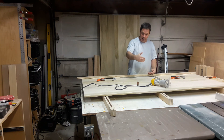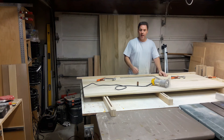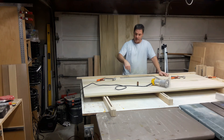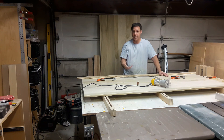I'll just repeat this process nine more times to do all 10 in between. When I cut this door — I've already cut it to length — I found out I have to cut about an inch off each long side so the width ends up proper. But as long as things are symmetrical, they look okay. Even if the distance between the first groove and the inside of the stile is a little shorter than the distance between each V groove down the panel, that's fine because it's exactly the same on the other side, so it looks like it's meant to be there.